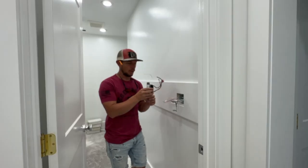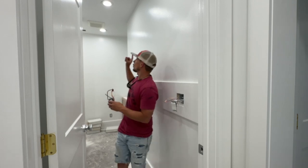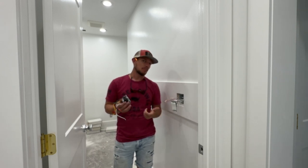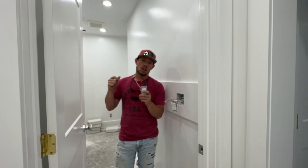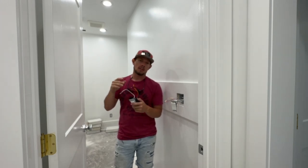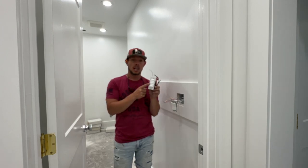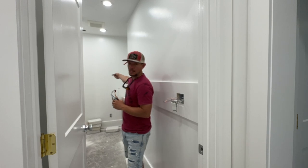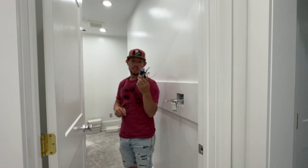I did that for a reason. If it's ever coming in near the shower, just boom hit that timer automatically so that it will turn on the bathroom fan. That's really recommendation number one I have for you: if you're going to put in fans, do not put them on a switch. Either put them on a timer or a humidity sensor. I went timers because I thought this fan is doing two jobs — it is pulling moisture out of this bathroom when somebody's showering, but also it's pulling the stinky air out when somebody's using the potty. So timer it is, and we can have two of these, one here by the tub, and then one kind of back around the corner by the toilet so that whoever's using it can just quickly turn them on and they work.